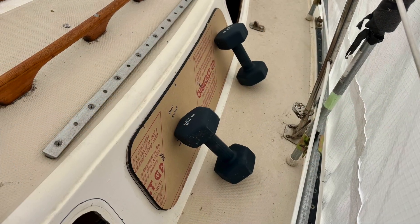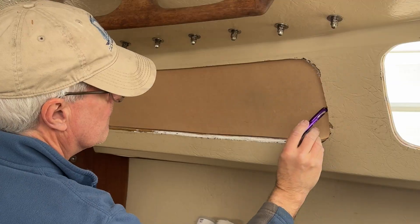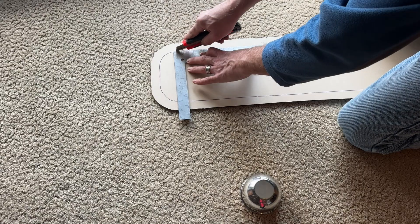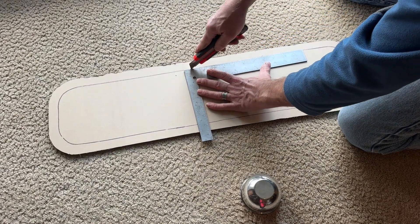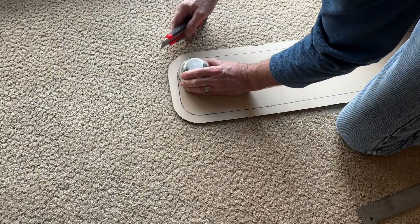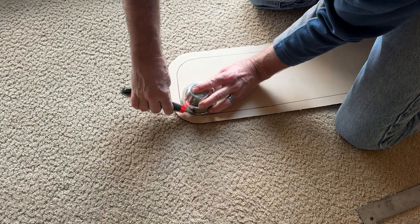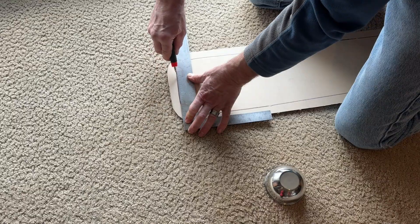The exact window positions are carefully determined and marked on both the outside of the cabin and the inside reveal on the window. To avoid seeing the cabin overlap on the outside of the window, we need to paint the corresponding border black on the inside of the window. Therefore, I carefully cut away the protective paper along the reveal that was marked on the inside.